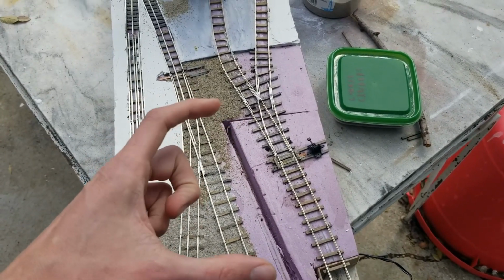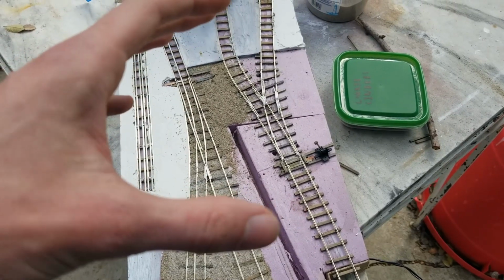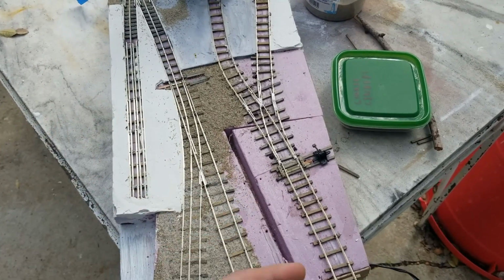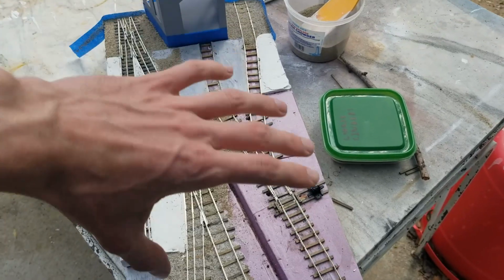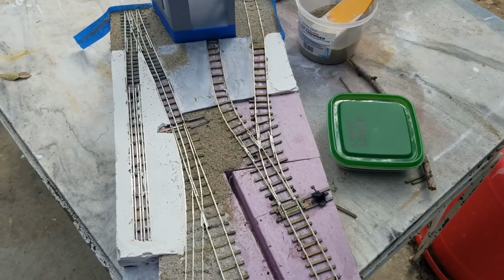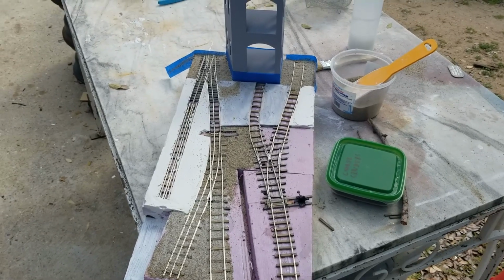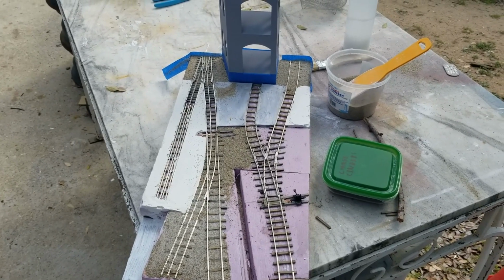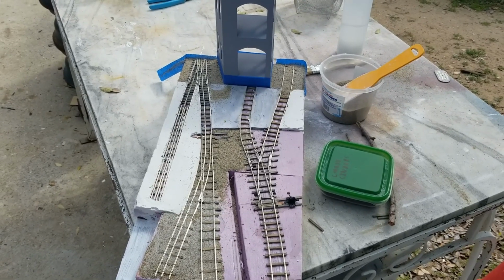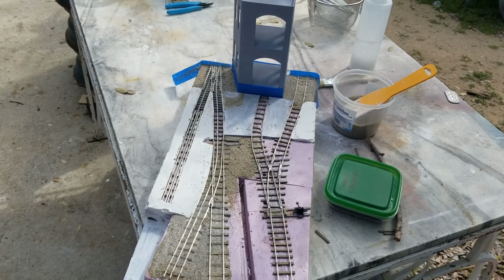Then inside the locomotive will be, I'm going to cover this in a different video, a Zener diode along with a couple of other things like a bridge rectifier and capacitors, so it can run through the dead track sections just fine with the capacitor bank on board acting like a battery, but I don't have to deal with batteries and charging and switches and things like that, because the idea is hopefully I can take this stuff and run it on a DCC layout, which has about 12 to 15 volts continuous running to the rails. I can drop it on there as well. So I'm figuring it all out as I go, obviously, but I'm really, really happy with how this is coming out so far.